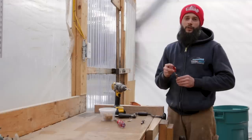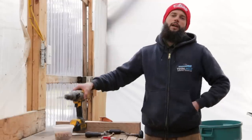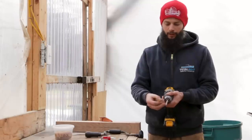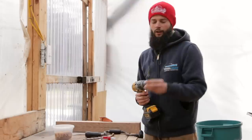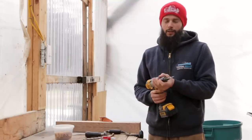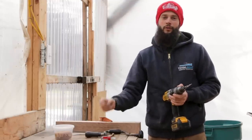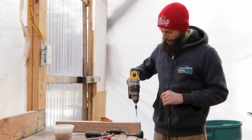Before we can put these screws in, there's a little prep work to do for the wood. We already drilled the pilot hole, and we did that with this tapered bit that matches our screw. So it's the same taper and the same length. Normally you would get a bit that also has the countersink for the screw head on it, but I stupidly ordered bits that were too short. So they're on their way, and for now we'll use the longer bit to drill the full length hole, and then we'll drill the countersink with this one. So now we'll countersink.